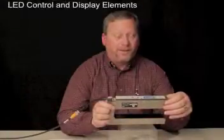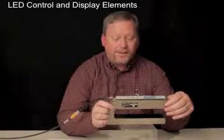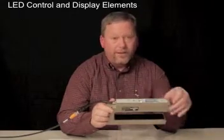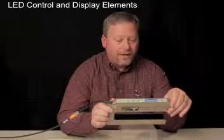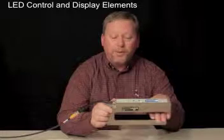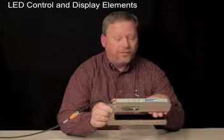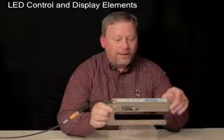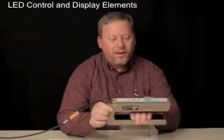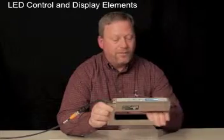First, I'd like to start off showing you the control elements of the DSC-17. The DSC-17 has the following control and display elements, which are located on the side of the sensor. The LEDs indicate and identify the position of the material as it's being tracked in terms of the upper and lower sections of the sensor. The LED bar graph shows the material being tracked in a regular operating state as it passes through the gap of the sensor.